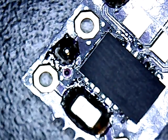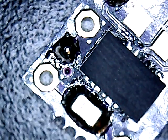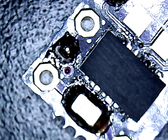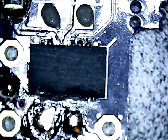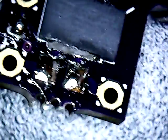I'm going to clear the solder bridges on the other board and then do the same continuity test on that one. Sometimes it's just best to apply power and see what smokes — that's really the ultimate test — but since these chips aren't exactly the cheapest, I don't really want to find out the hard way. I've cleared those shorts out on that other board, so I'm going to call that one done because it looks really good now.